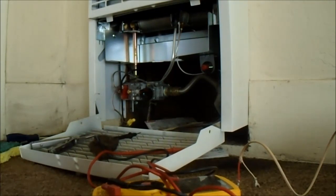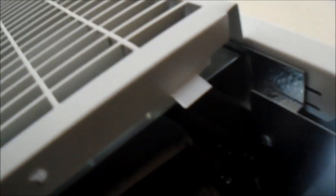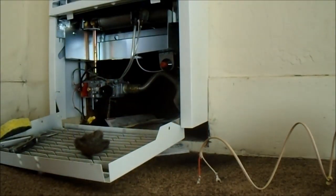The pilot light is lit — you can see it's lit. I cleaned up the thermopile a little bit and the pilot flame seems to engulf at least two thirds of that pilot generator. The thermostat wire goes up to the high limit overheat switch, which I checked with a meter. Now we're going to check the output of this thermopile right here at the meter.